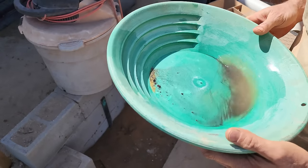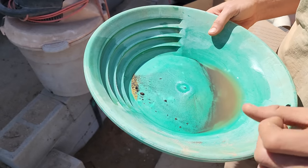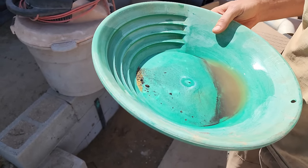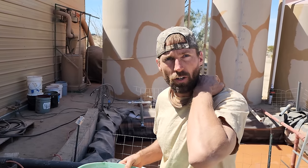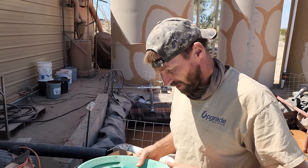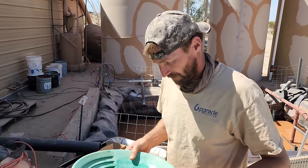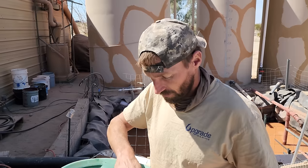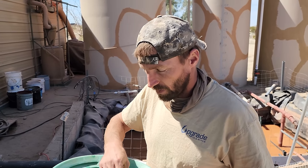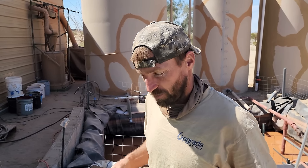The primary cons is just a primary speed pan. In this particular deposit, the gold's associated with iron and manganese, and so it's very hard to pan the two apart. It'll carry it right out of the pan. So if I look at this black sand under the microscope, there'll be gold stuck to a lot of it. So there's still quite a bit of value in there other than what we can see right now in the pan. You're definitely going to want to smelt it. Or put it into a little mini ball mill jar or something and try to crush it a little bit more, get it real fine. But it's more fun to play with fire.